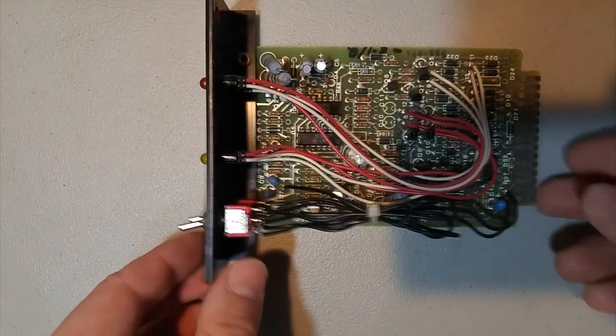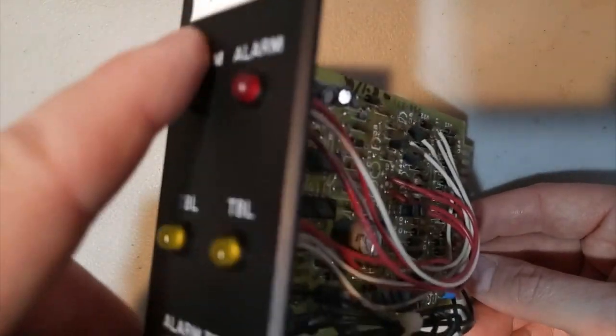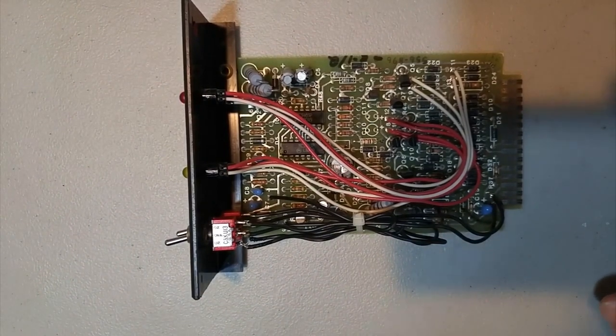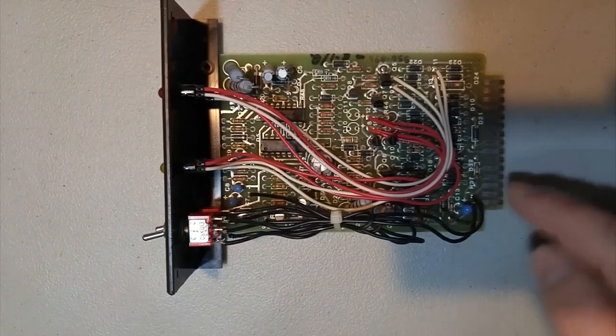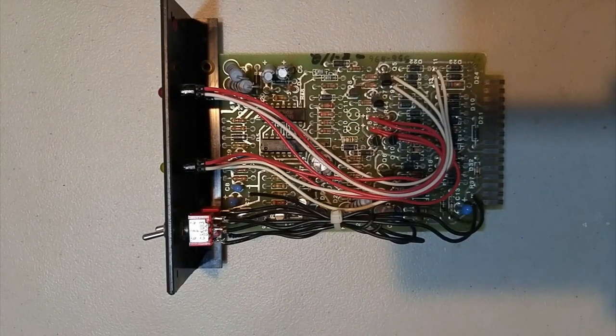And then you got your zone cards, like these. Now this one has a horizontal light one, but they also have one where the lights are arranged vertically. I don't know why they have to have two, but they do for some reason. This one's got the enable-disable and the test switches, of course, and the connector on the end. Now there's a small logic circuit in here made of some ICs. There's no microcontrollers at all on this panel. It's all based on solid-state logic and some relays.